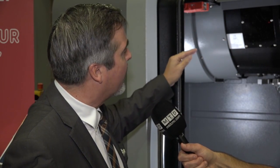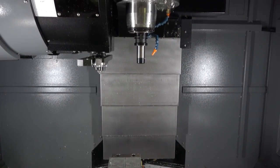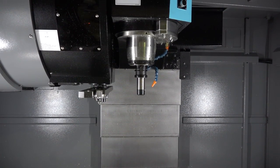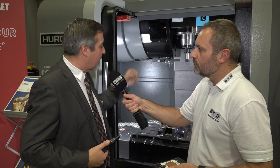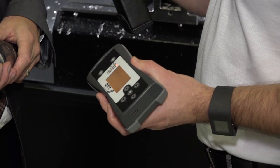What we've done is you can actually put the tool into the tool change carousel, call it up as tool 22 or 21, and then by means of a radio signal it sends the reading to a handheld monitor — so we can do it remotely.